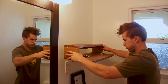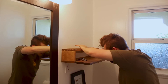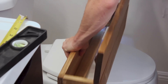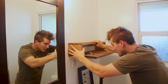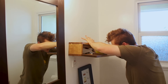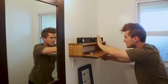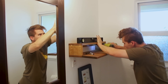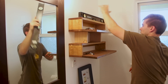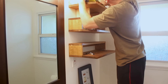Last step was hanging. I placed the first shelf where I wanted it to go — center of my wall, right above the outlet — and marked the location of the first hole to drill. I then pre-drilled a hole and moved the drill bit over 16 inches to drill the second hole. If you're in the US, your studs should be 16 inches on center, so it takes the guesswork out of finding your second stud. Then I drove in the first screw, using two and a half inch wood screws to go through the shelf and drywall into the stud, checking to make sure things were square before driving in the second one. I cut a few spacers back in the shop the exact same length to easily space out and repeat the hanging process with the next two shelves.